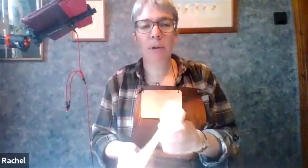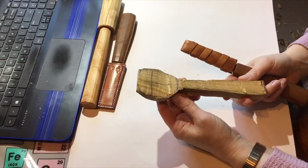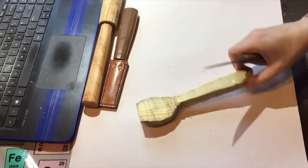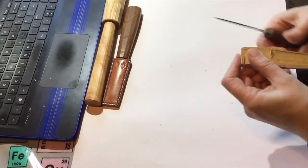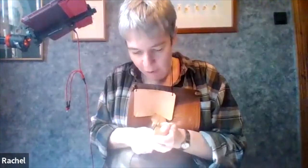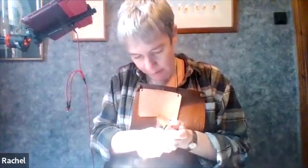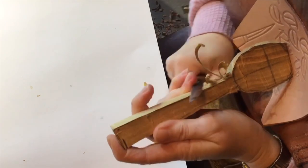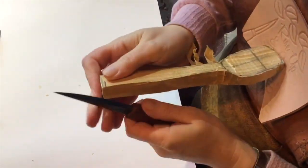Okay. So my process starts with carving the three planes. My first action will be to carve down the side, around the sides. So just do your normal thing, Kevin. We want to carve down to that line. I'm not really worried about the line. What I'm worried about is making sure I get under any axe marks. So I'm not really concerning myself with getting exactly to the line. If I go over to get under axe marks, then that's absolutely fine.